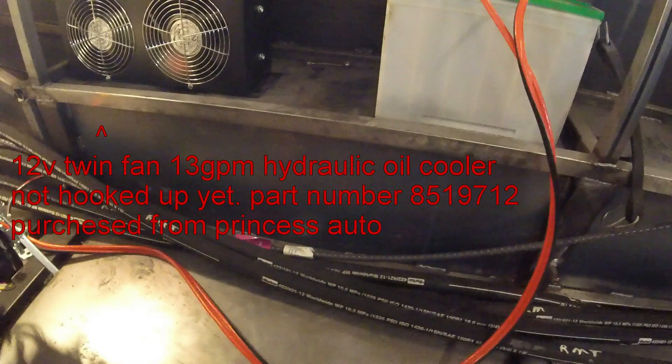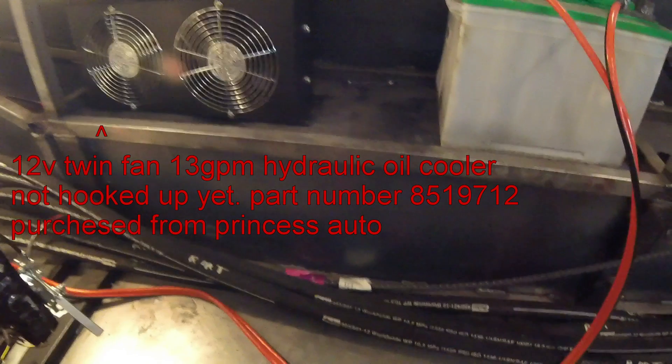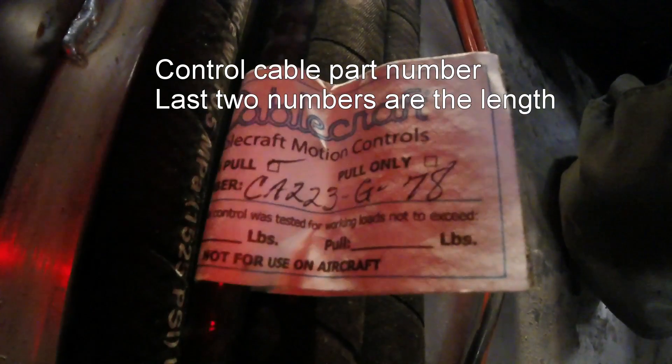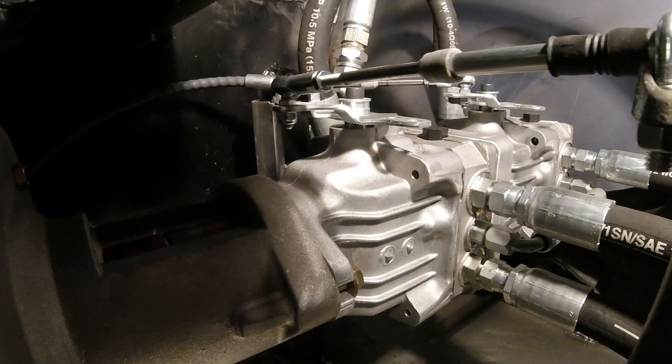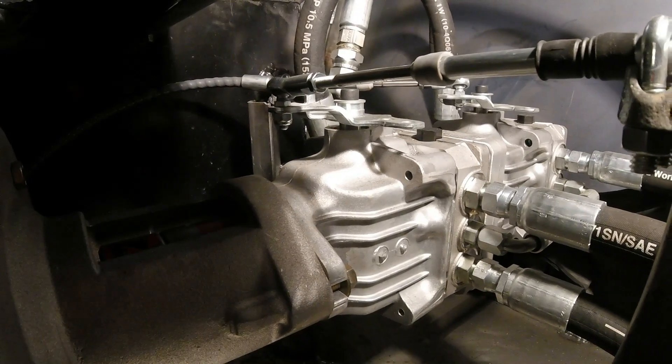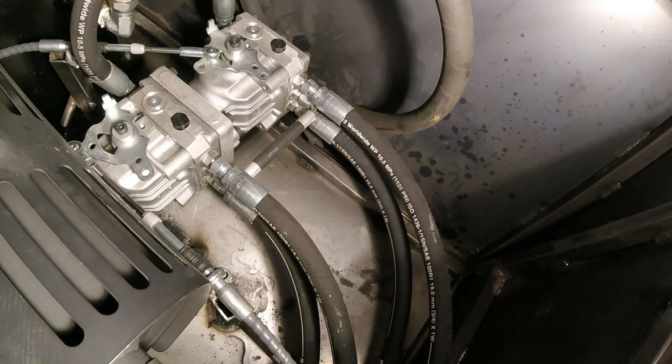Here's the controller for the left side. It just kind of follows the hydraulic lines, comes over to this bracket, and is pinched right there with a U-bolt to keep the cable from flexing. It goes to our front pump and connects to the plate that changes the flow path of the hydraulic fluid. So that's forward, and this would be reverse.